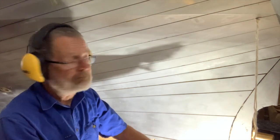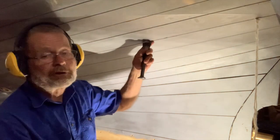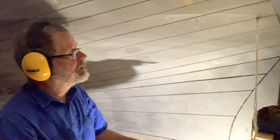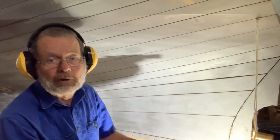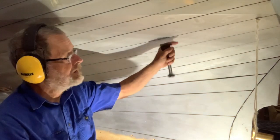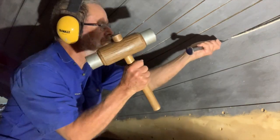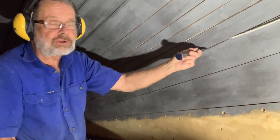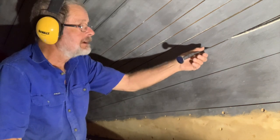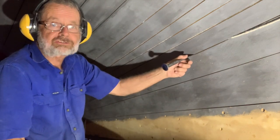The evenness of the hardening up is the most important point in caulking. In a perfect world the depth would be perfectly even all the way along — on most boats, including mine, it will vary slightly. This is not a problem as long as you have enough depth to hold the seam compound. If the seam compound doesn't have enough depth it will simply fall out quite quickly. You need the depth of the seam to be greater than the width, so there's enough seam compound to grip onto both planks. When you're hardening up you can really feel — and even hear — if it's still driving into the seam. It sounds softer and duller. When it's nicely even and hard, there's a constant feel and constant noise all the way along.